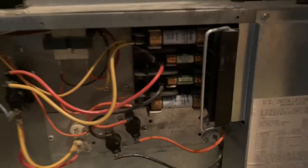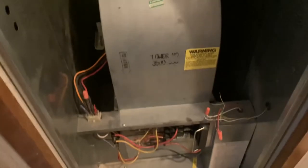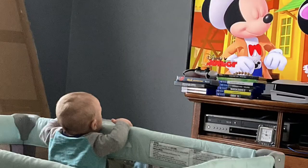Sadly, the fuses didn't help the problem either, so my husband decided the next step was to try to find a sequencer to put in it, but we couldn't find any in stock, so we had to order one. Flipping the breaker to get the furnace to kick on stopped working, and I keep my grandson three days a week, so we needed to get this figured out.